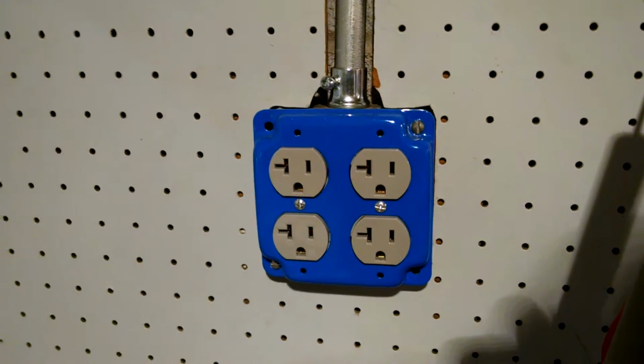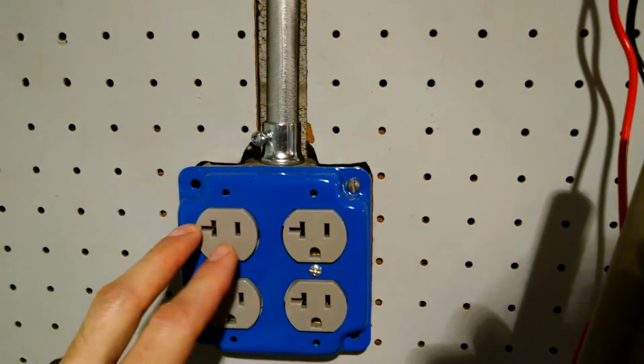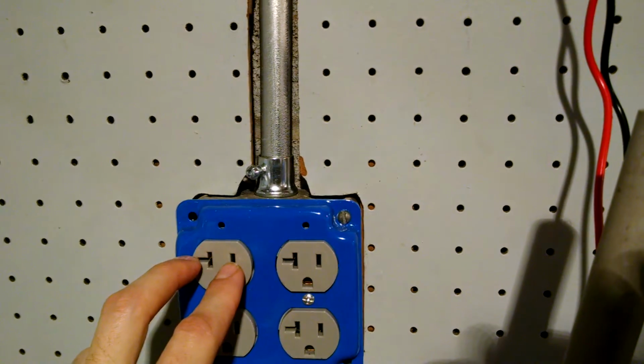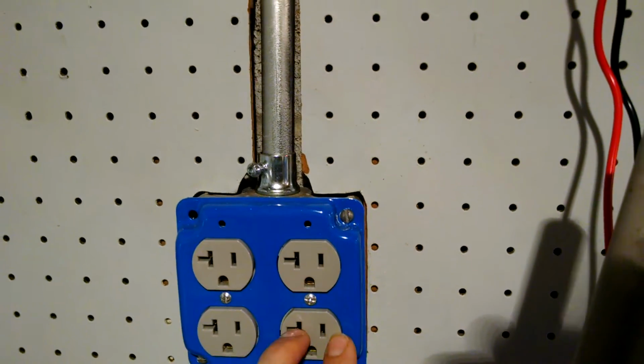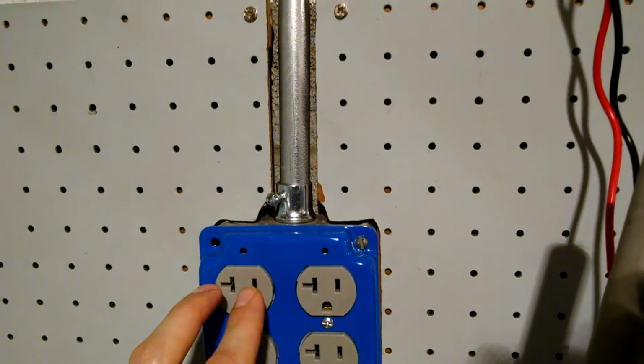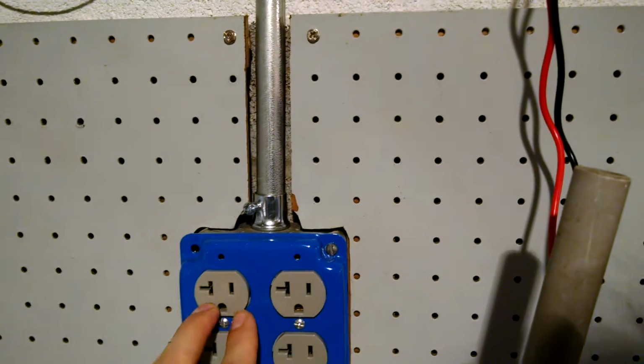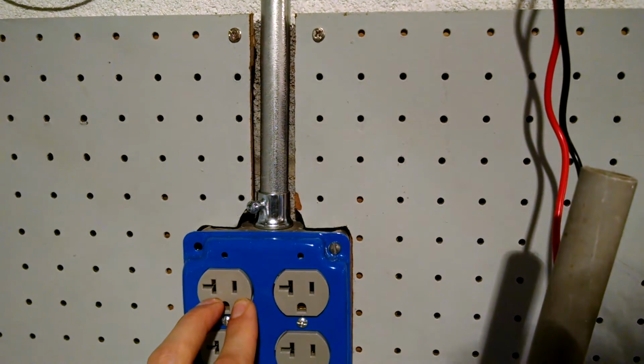So in other words, you would have your power come in here and plug into the back clamps of this receptacle, and then rather than running another one from here to here to power this, you would actually run from here to here. So you can actually put 2 sets of cables in the back of this, because the back clamp has room for 2.